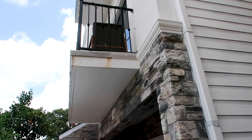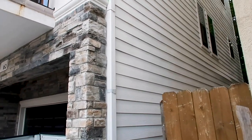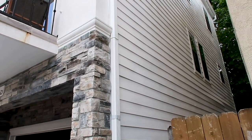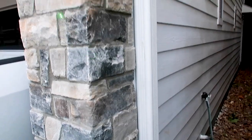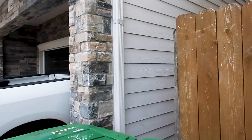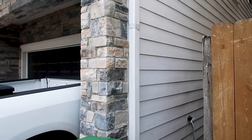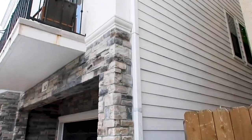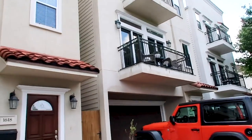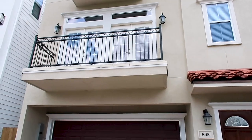Another sign on the neighbor's home: you can see the rust color on the stucco, and on this adhered veneer stone (AVS), they didn't do a good job putting overhead flashing on this lip. You can see discoloration — this white staining is called efflorescence, which means moisture is actually wicking through the wall and carrying minerals with it. So there's moisture intrusion on the neighbor's AVS too, which is installed practically just like stucco. The same people who built this home built that one, and you're probably going to mirror the same issues, even with a fresh coat of paint.